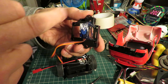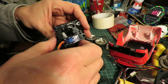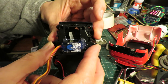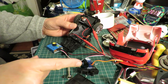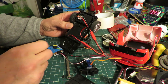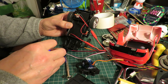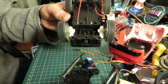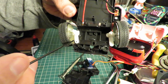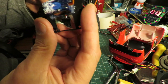I've cut the top out of that plastic section, squeezed the servo in there, and hot glued it in place. I've just soldered connecting leads onto the existing battery position so we can try and use the three AA batteries. I've just drilled a hole in there, so I'm going to use a bent paper clip to go down through there, come across at an angle, and go into the servo horn.